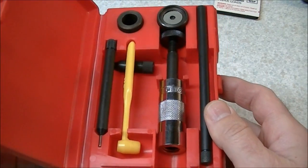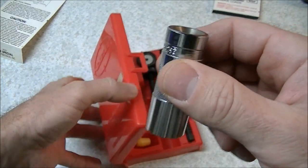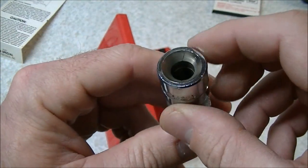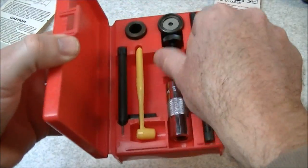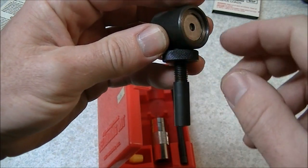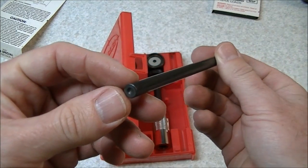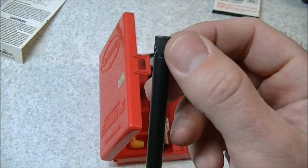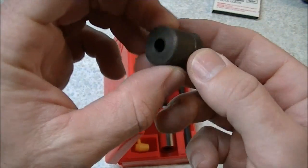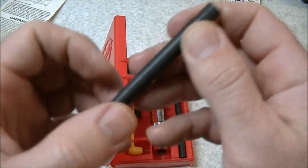Inside the plastic box we've got a few items. The main one is the die body itself, which is what you use for most of the actions. It's two-ended — one end with a stepped recess is where the cartridge case goes in, and the opposite end is funneled for adding powder. We've got the priming chamber, which has a spring-loaded washer and is used to prime cases. The opposite end is a rod used to seat bullets. There's also a long knurled rod which is the priming rod and knockout rod, with a dimple on one end. And the decapping chamber, used to decap brass and for a couple other steps, along with the decapping rod which has a decapping pin at one end and is knurled at the other.